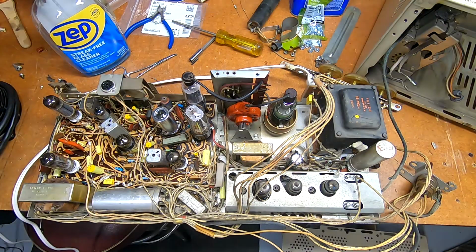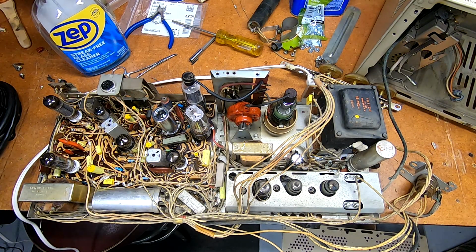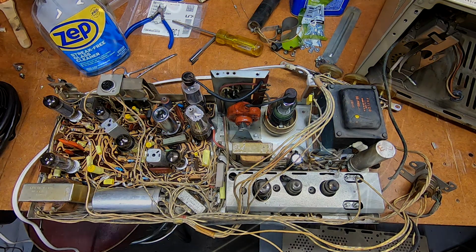And yes. Yep, and the horizontal oscillator tube maybe. Yep, I think I see the dual filaments for that one coming up. Yes, we do. All right, that was the problem. Two grounds not connected. So, everything is lighting up. Excellent. That means I can reconnect it to the set again, and we can see if it works.